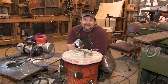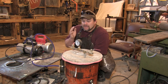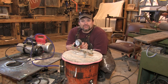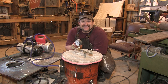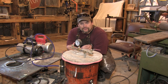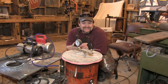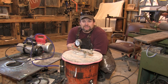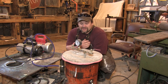Let's start with why you need a vacuum tank. If you're doing sand casting, you have vents that allow air to escape. But when you're doing plaster, there's really no way for an air bubble to escape once you pour it before it sets up. If you stir the plaster aggressively, it's got air bubbles trapped inside. Traditionally you could use a concrete vibrator to try to get bubbles out, but in really fine jewelry work, small bubbles are a real problem because they tend to stick to your wax. Even a bubble that's an eighth of an inch stuck to a ring is a real problem. So when you do investment casting, having a way to extract all the air — even from the liquid plaster — is terribly important.